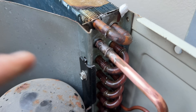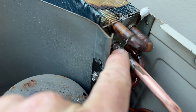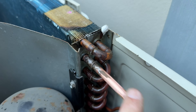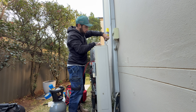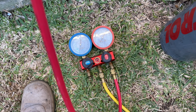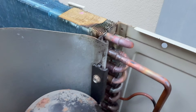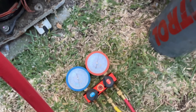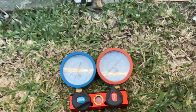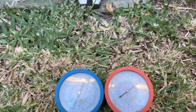This thing has definitely been repaired before — it's got all silver solder on it. I feel like where it's leaking is where it didn't bond very well. So I've just cleaned up the copper and put a lot of flux on it. It's a way better solder join now — before it just looked a bit lumpy, so I cleaned it up and re-soldered it properly.